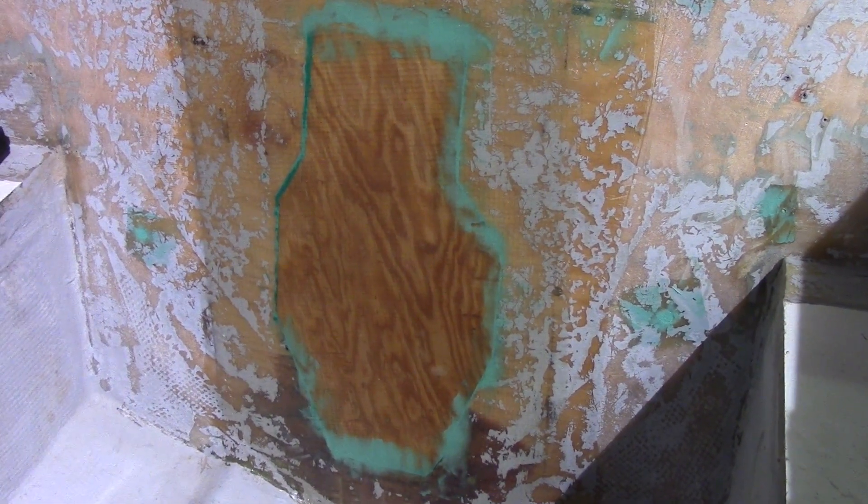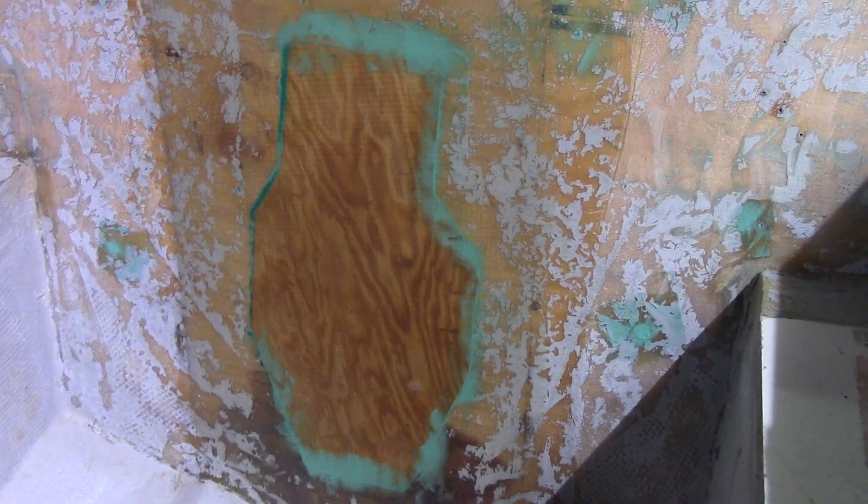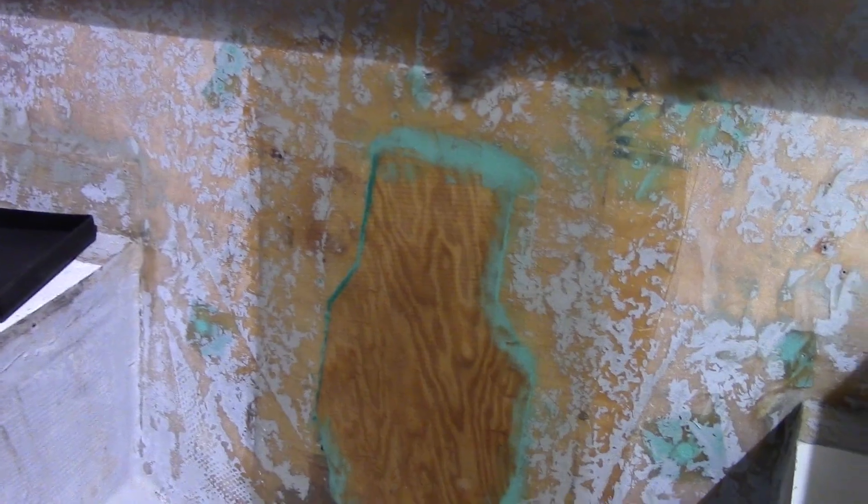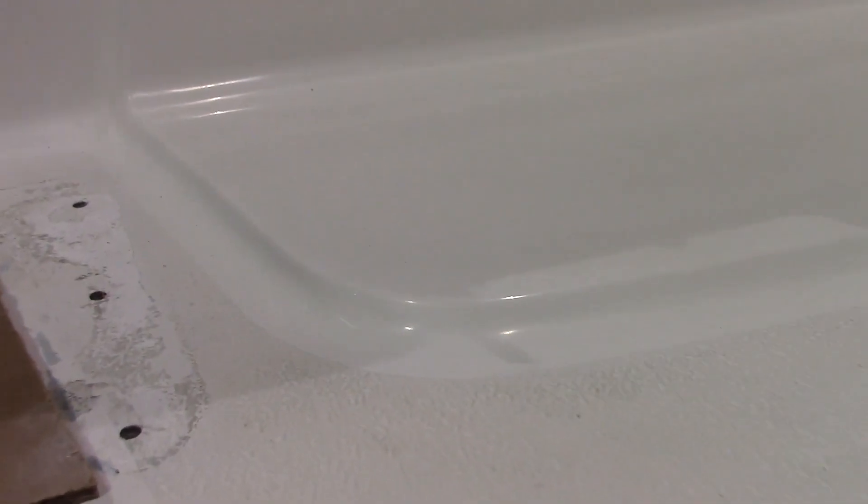Here's the inside showing the finished fill-in. It has mat and roving fiberglass, and the green material is the polybond we use to paste in the plywood. No fairing is needed here as it's not required. We're going to put plywood over this whole surface to give it extra thickness and strength, and this piece is now installed.